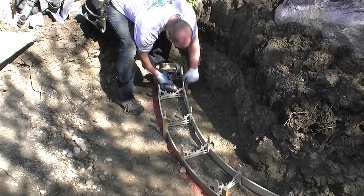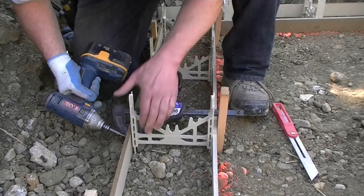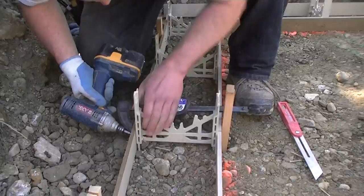After that's done, fasten your spider tie from the outside. On the inside board, you'll level the spider tie first before attaching it. This will allow for your stacks to remain vertically straight and everything should fall in place perfectly later on.